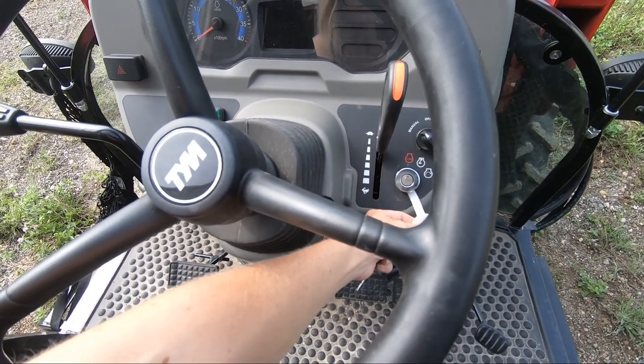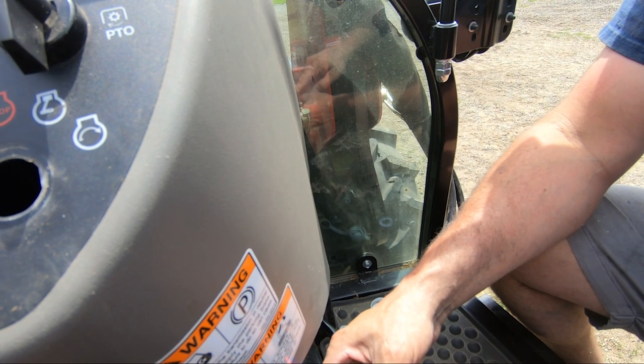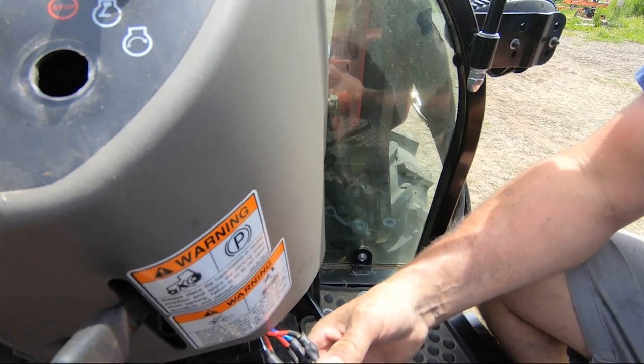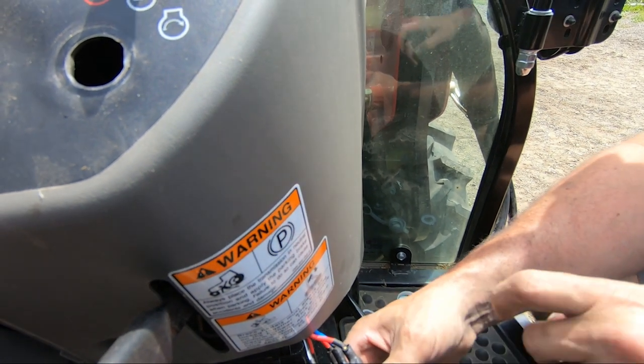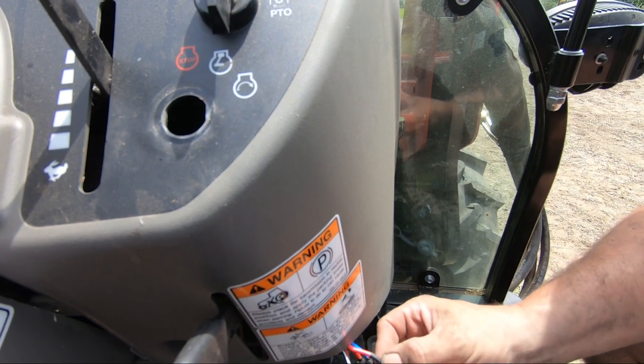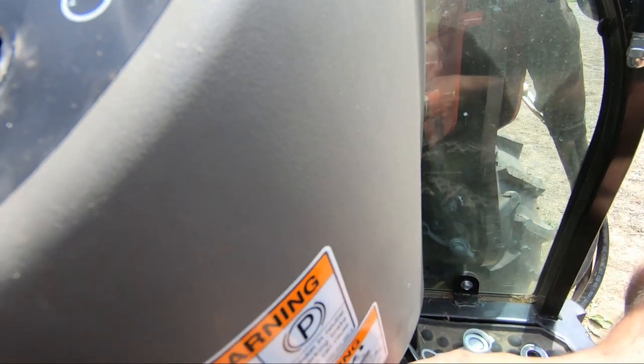There are a lot of safety checks on this tractor to make sure it doesn't catch on fire or create irreversible damage. So you take your key out, this twists off, this comes off, and then this little thing right here pops out through the bottom - it's literally that easy. If you're concerned you have a wiring issue and you have a hand throttle like on our model, pop that ignition switch out, it'll drop through the floor, and there's enough cord that you can check it out. Once it's pulled out and not touching any metal, you can see the problem. If you throw the fuse in and it doesn't pop, that was the problem - guaranteed. Look at that - it rubbed right through down to the metal.